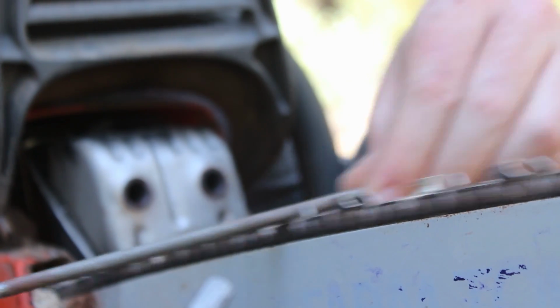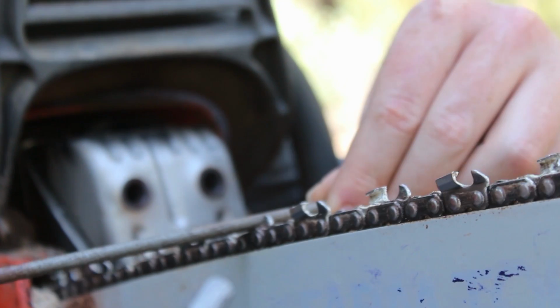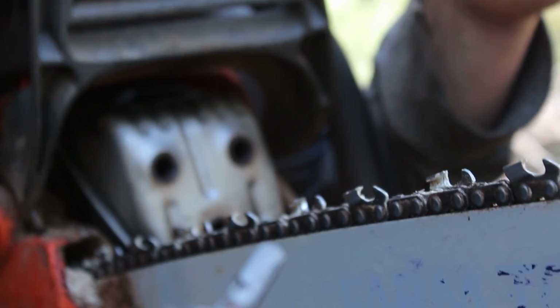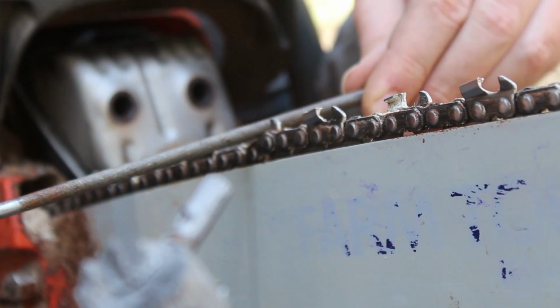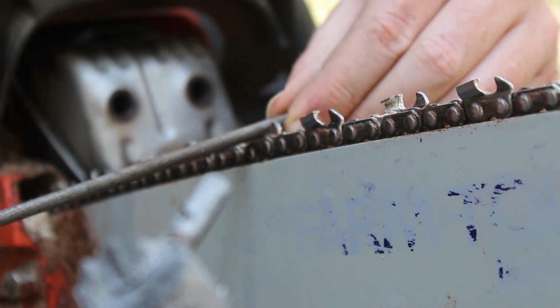Now, as you see, the chainsaw blade will want to roll on its own, but then you pull the safety bar, as up here, you push it forward, locking it into place. And then, once you do that, it doesn't move anymore. And then you just pull back on the tooth a bit. See how the tooth naturally kind of tilts?